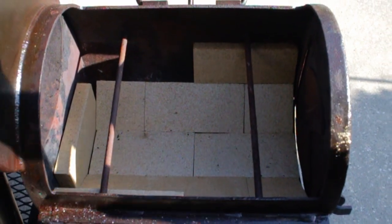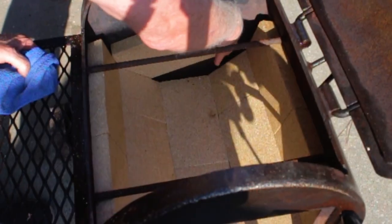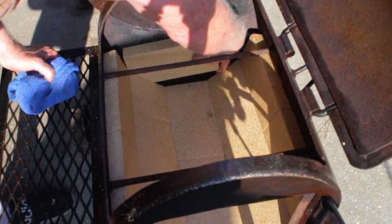On the top row, I ripped off a few inches so it would accommodate the bars that hold up the grate in the firebox. Extra bricks were used to close up as much as possible of the firebox throat, because it's believed that this open throat area is way too large on this particular pit. I'm going to have to test it out before I make any other major changes.